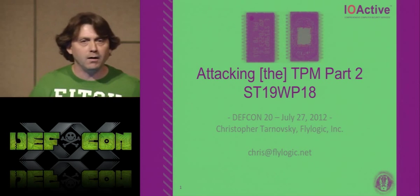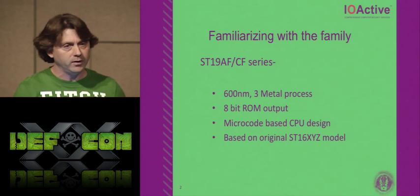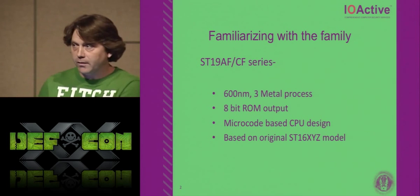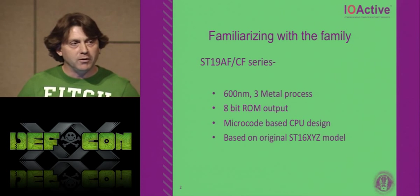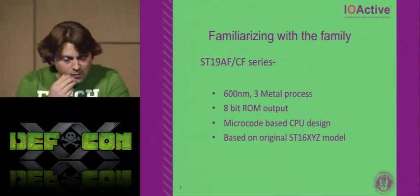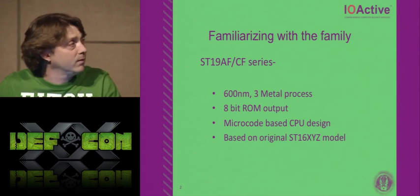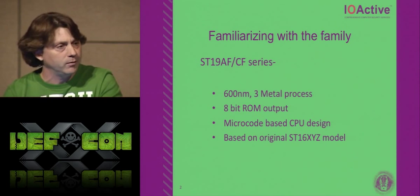So, who here is familiar with ST smart cards? Okay, so let's go back in time a little bit because I want to make sure that everybody understands the principles. This is all about the principles. You can shrink to 90 nanometers, for example, the ST23 today, and you can get your EAL6 Plus rating for Common Criteria. But honestly, it doesn't mean anything. If you take the time, polish down the chips, do your imaging, what I'd call your due diligence, you find out that it's really not that complicated when you break it down into simple terms. So everything that ST makes today in their smart card field, that is 6805 variant, it's all based on their past. And that's why I always like to say you're only as strong as your past. Because the first thing that I'm going to do is go look at your past, and then look at newer, and I'll then slowly advance up to today.